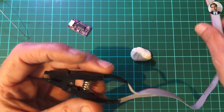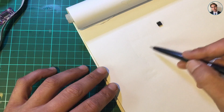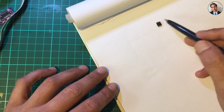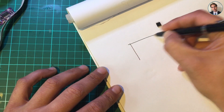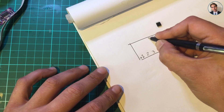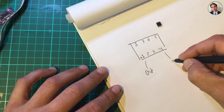Now the challenge of figuring out which wire is which. Let me grab a pen and paper. The pins on the ATtiny85 — every ATtiny in a SOP8 package has the same pinout as a DIP8. Pin 1 is where the marking is, going up to pin 8. Pin 1 is reset and pin 4 is ground.